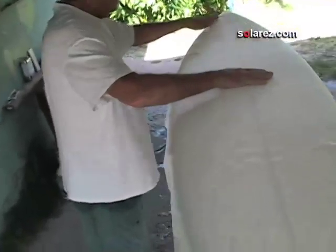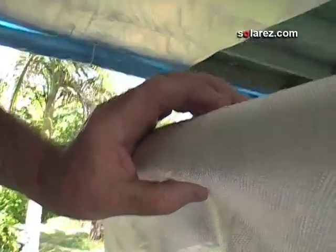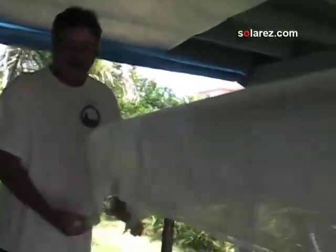I'm going to iron this out, leaving about an inch to lap over and get to the flat part of the board — depending on how rolled the rail is, so it'll probably be right about there. The edge is right there — about that much getting into the flat. That'll help the sander; the easier you make it on yourself, the less work you've got to do later.